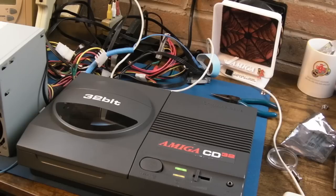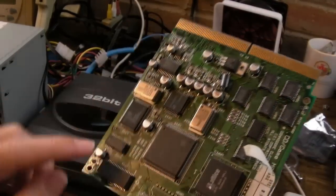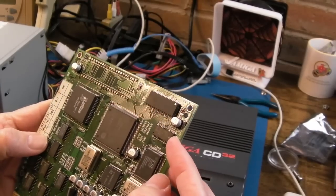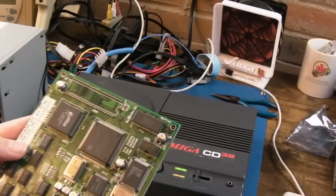The sound is clearly the issue - the video is rock solid, crystal clear, and stable. That makes you think about audio decompression. There could be separate RAM for audio decompression and separate RAM for picture decompression. Looking at this card, we've got a RAM here and a RAM here. I'm thinking one of those could be the problem - I'd expect the small one to be for audio.